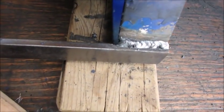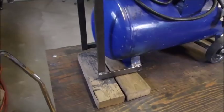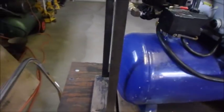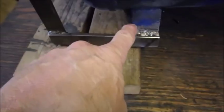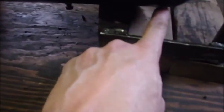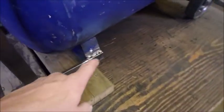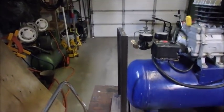Alright, there's my handle. Looks a little clunky, but it's going to work — they should have had something like that on from the factory. I measured off this bracket, and there's about three-quarters of an inch between the bracket and that weld on this side, and an inch and a half on that side. So I made this bracket exactly square and tall, and then I had to bring this one back because the factory one was crooked.